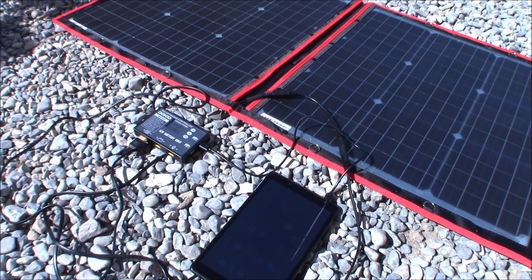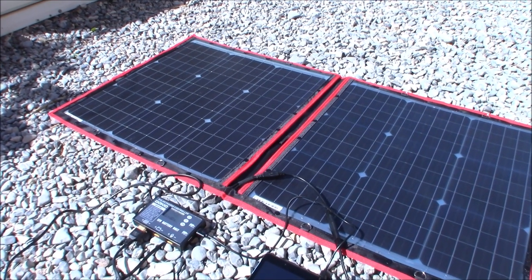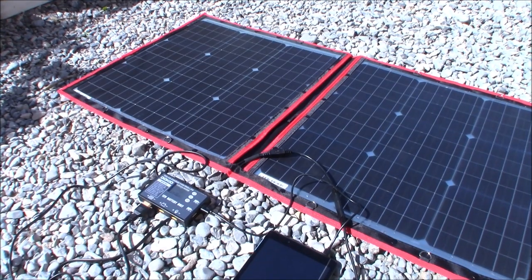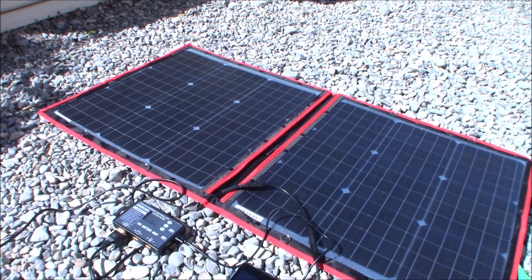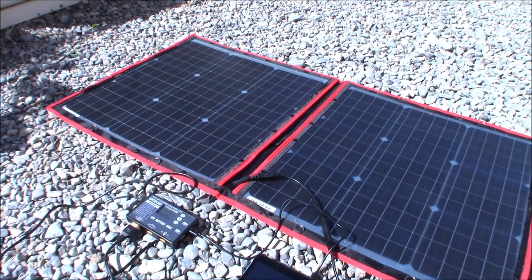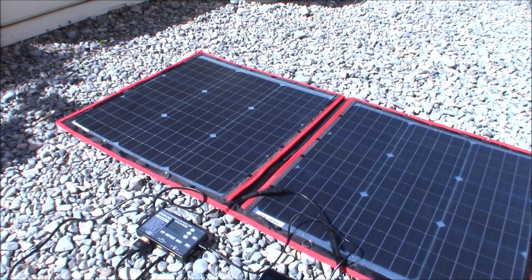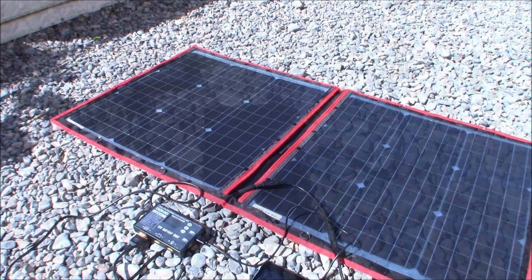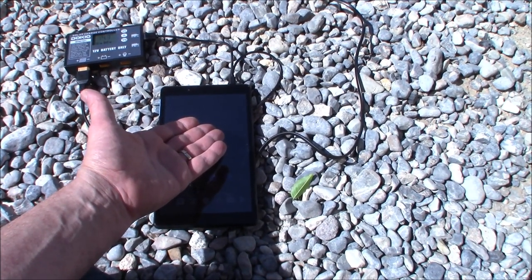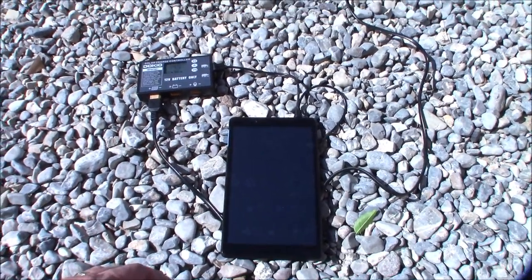This is really an affordable way to start your own solar system — easy and simple to set up, really easy to deploy. You've got your charge controller, all the components you need; all you really need to add is a battery and an inverter. When I shut off the camera, I realized it was 9:43 and it had been about 9:38 when I stopped. We're already at 60% — that's about two or three percent in ten minutes. It's still going along great.